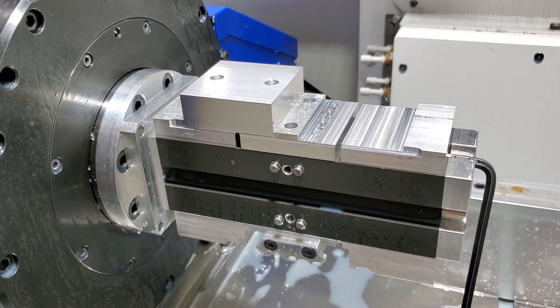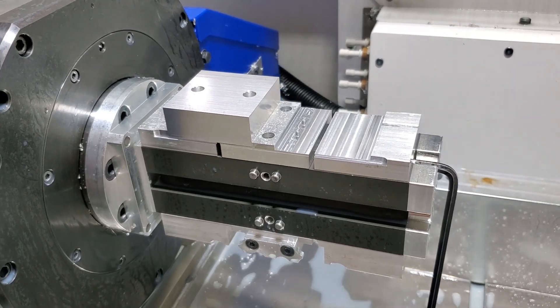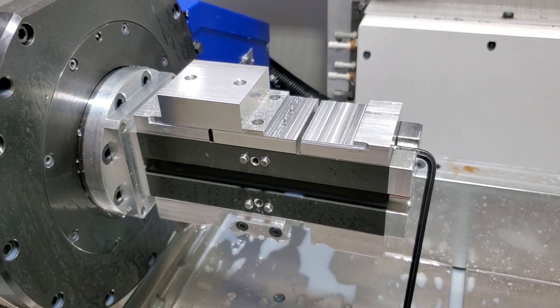On this part, it's only a two-and-a-half axis part — no reason to have it on the fourth. The only reason I'm making them on the fourth is that's where my vises are for now.